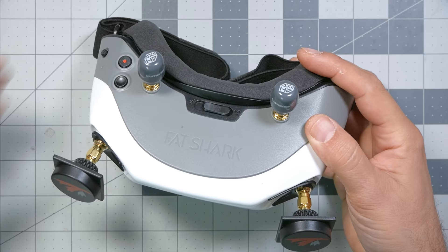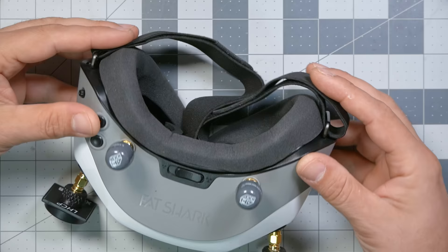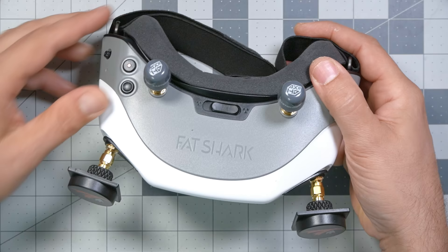There's one more gotcha with these goggles that doesn't affect you directly but pisses off your friends. The DJI and Fatshark goggles use bi-directional communication systems, meaning the goggles transmit as well as receive. An effect of that is if you bring your goggles too close to another person who's flying, you will interfere with them. With analog you only have to worry about the proximity of your video transmitter. But the big difference with the Fatshark system is that the goggles begin transmitting as soon as they power up — with DJI, if your VTX is powered down, the goggles don't cause interference.